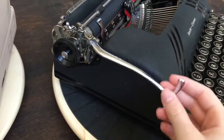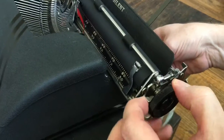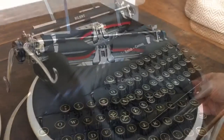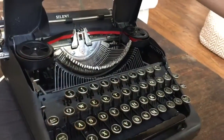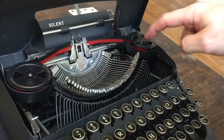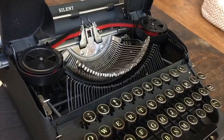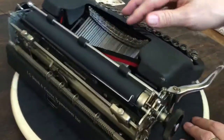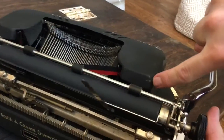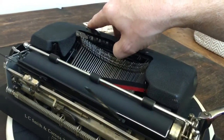On this side we have the carriage return lever as usual, and then back over here there's the little carriage centering lever. So when you're ready to put it in the case, just push that knob down and it stops halfway so that it's centered when you put it in the case. A couple of quick notes before we do the typing test: under the hood, in addition to the manual ribbon reverse lever, it does have the forks. You want to put eyelets on the ribbon so that when it gets to the end of the ribbon spool, the eyelet comes out, hits the fork, and triggers the ribbon reverse mechanism. Also be careful when you open the hood — make sure the carriage is far enough to one side, otherwise the ribbon cover can hit the chrome. So move it all the way over before you lift up the hood.